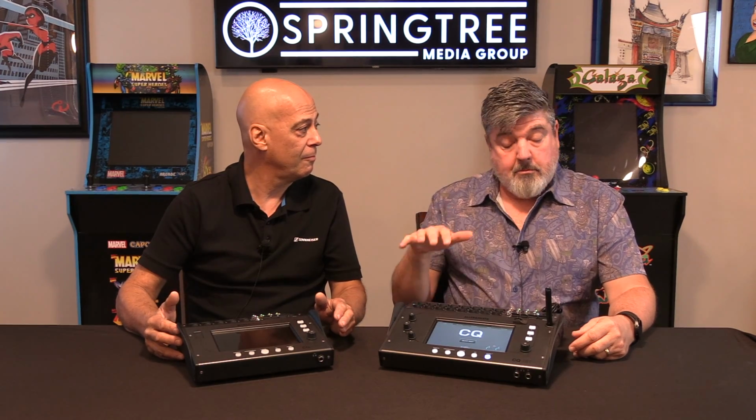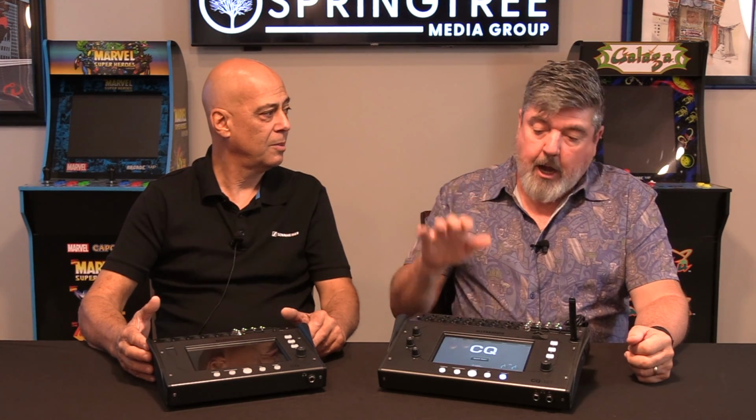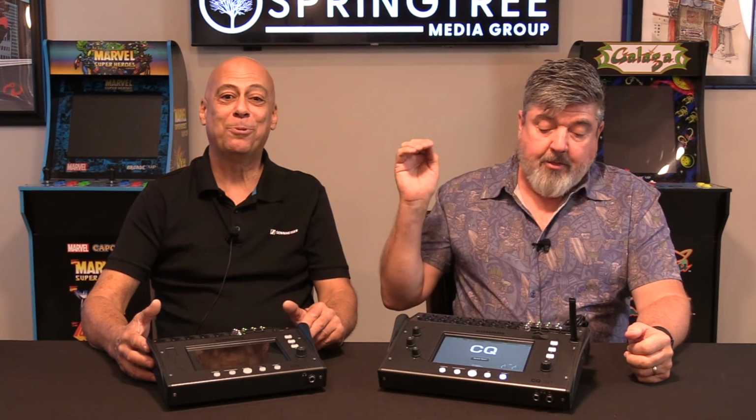And it's even better than he's saying, because the brainiacs at Allen & Heath did something I think is really smart. You can use this two different ways. You can use it in a basic mode, or you can use it in a complete mode, which gives you total control over everything. But they got some really cool things on here. They've got auto gain on it where you just plug the mic in, it automatically sets the correct gain for it, and it watches it the whole time, so that if you're starting to peak it, it will adjust that for you. That is pretty serious. Built-in feedback suppression on it. So once it gets up and running, you don't have to sit there and ring out your room. It'll do it for you automatically on the fly.